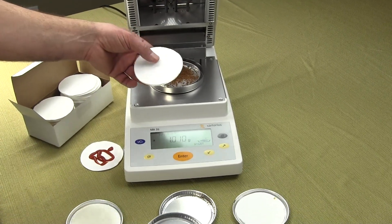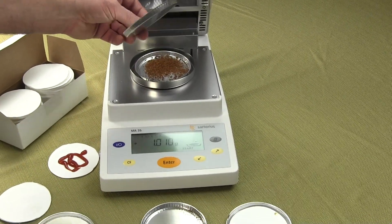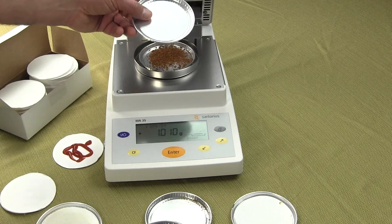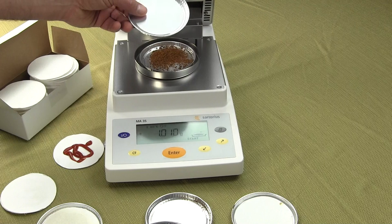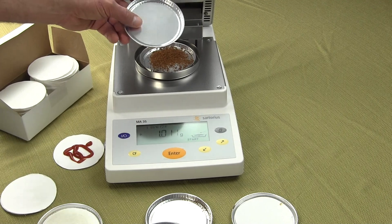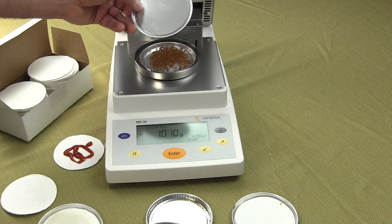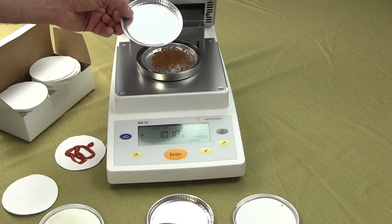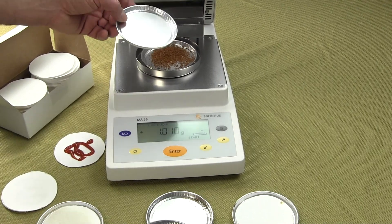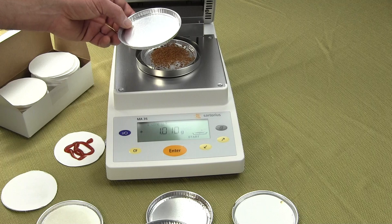Regarding the aluminum pans: a lot of people say you can use any pan, but that's not the case. These disposable pans have a smooth bottom — the goal is to maximize surface area with no divots or valleys, because you won't get proper drying otherwise. If you have any questions, give us a call. We're Precision Weighing Balances, find us at thebalances.com or scaleman.com. These pans and filter pads are compatible with the Ohaus MB35, MB23, MB45 moisture balances, the Sartorius, and the Mettler, but they will not work on A&D or Shimadzu moisture balances. Thanks for watching.